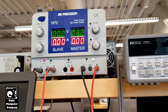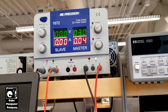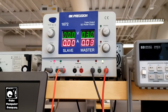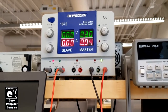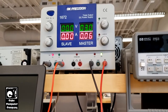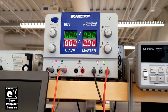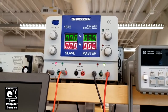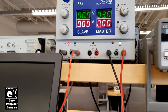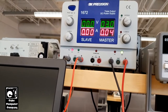We're drawing about 30 milliamps. The reason we're drawing a little bit of power is because switch mode power supplies have dummy load resistors on their outputs — there must be some load on them in order to start. I'll touch it again — about 30 to 40 milliamps. I'll take it off and watch: there's a brief spike as the capacitor charges up, then the capacitors discharge through that dummy load resistor. Now doing the 3.3 volt rail — about 60 milliamps, no short. Then the 5 volt — 40 milliamps, again because of the dummy load resistors.